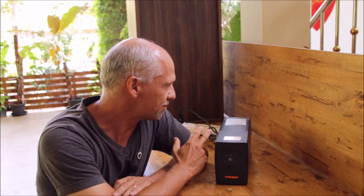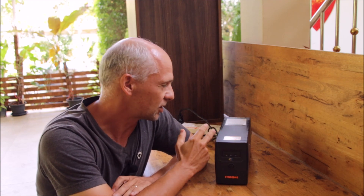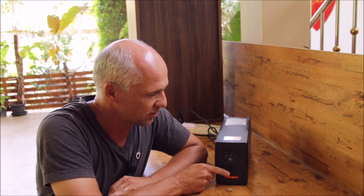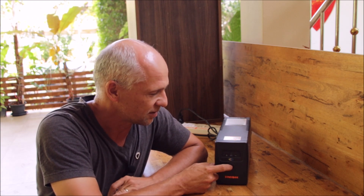This is a voltage which is missing. The control board cannot be set to output that extra voltage which would be required so that you have the correct voltage levels on the battery cells. So this is an extra missing part of energy on the top of the battery, and on the bottom it's causing a little bit too much of a discharge. That's why when the battery is depleted, the control board will actually not stop depleting the cells until probably the BMS turns off the process. And that's why when we try to turn it on, nothing will happen because the BMS is shutting down our system.